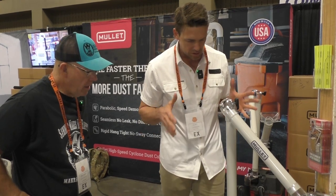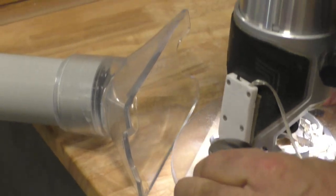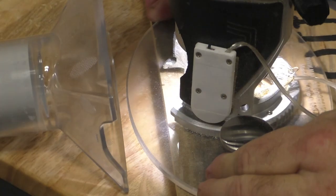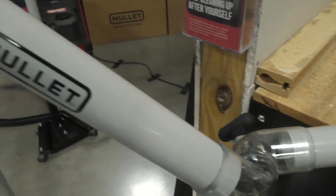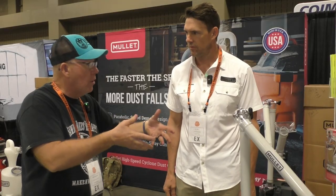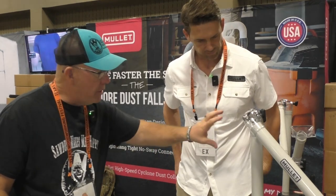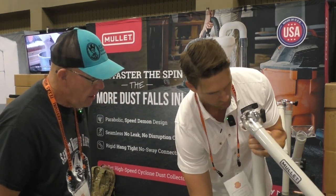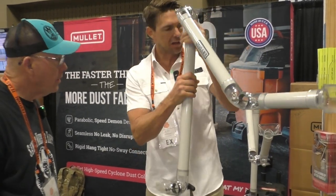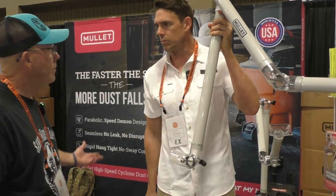What we're doing is targeting all the suction power of that vacuum and dust extractor at the hood up front, so as you're working on things where you can't naturally get dust collection — at the source — you can position this hood right where you're working and collect as you work, as opposed to having to clean up more after yourself. For people who are freehand routing or sanding in an area like an apartment or spare room, dust collection is huge. This apparatus is based off an inch-and-a-half schedule 40 PVC, so it can hook up to a shop vac or a workbench. You can find PVC at any home center or hardware store.